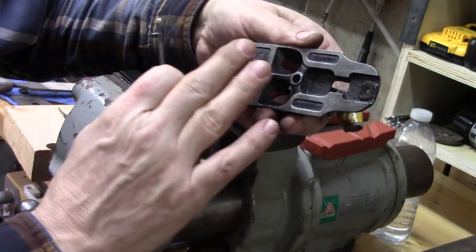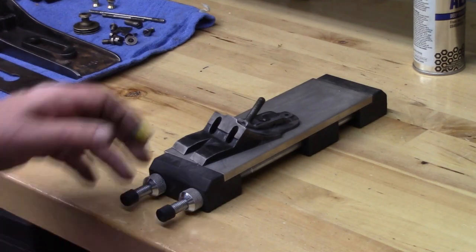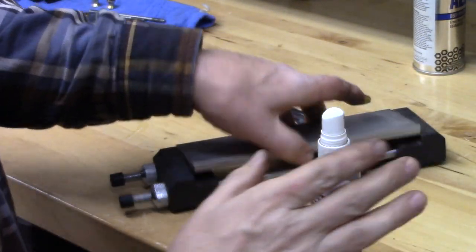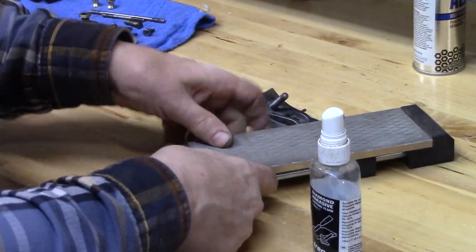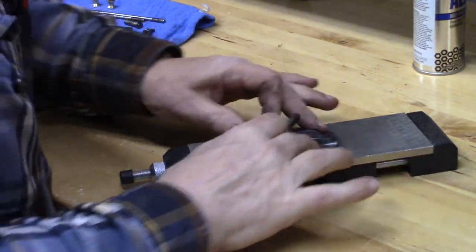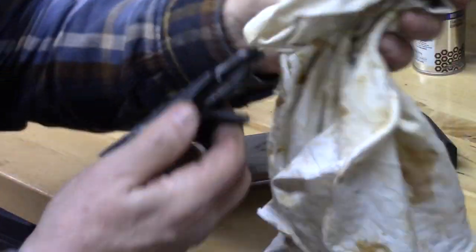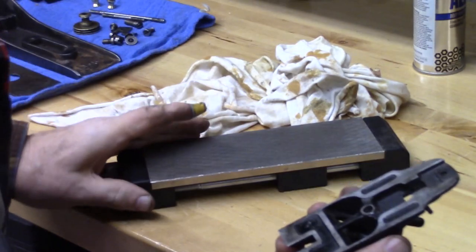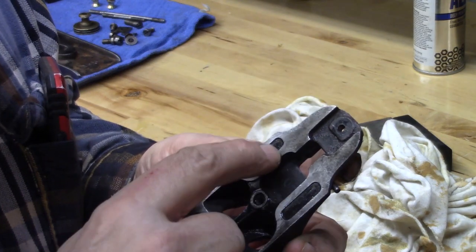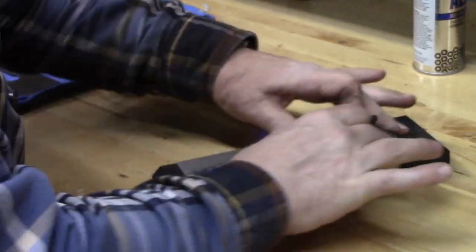Now we can flatten the surface so the blade can ride on it without any chatter. So let's begin by flattening this face of the frog. We'll start with a 300 stone just to see where it is. We'll do this just for a few moments and we'll look at it. Yeah, so it's not very flat because you can see certain areas are starting to come off and certain areas aren't. So that's good that we started with this grit because we need to take down the high spots